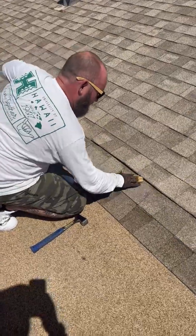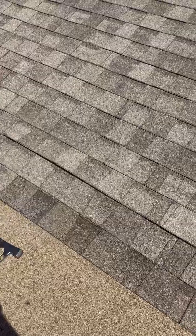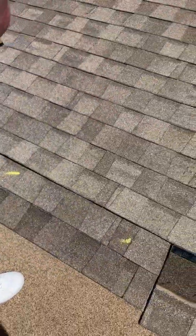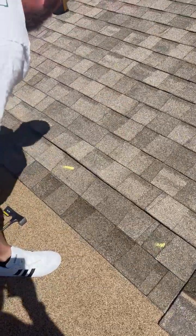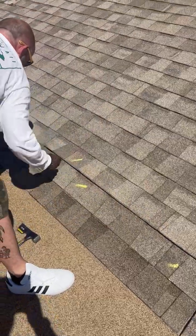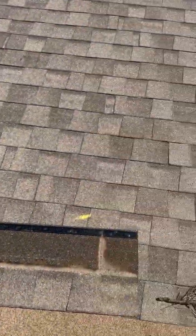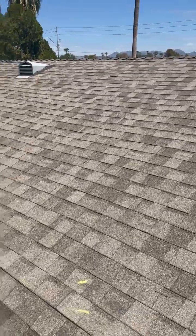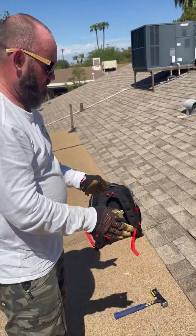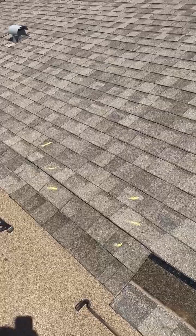You can see that by manipulating them it's caused a bunch of granule loss up here, but also this shingle and this shingle have had the fasteners pulled out, so those are going to have to be replaced — they can't be reused. Which is going to happen to this shingle and the shingle above, causing a domino effect all the way up the roof. Every shingle has two shingles above it, so replacing this one shingle means we have to replace the two above that, the four above that, the eight above that, the sixteen above that, and so on all the way up to the ridge.